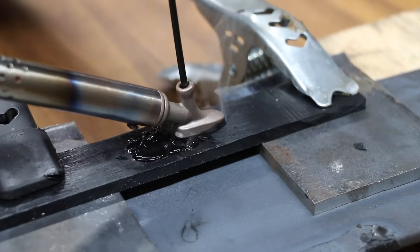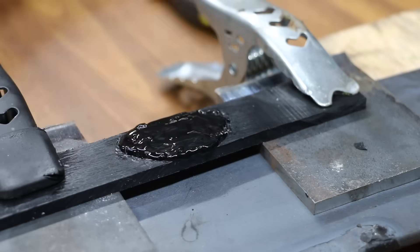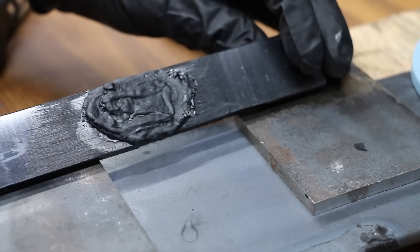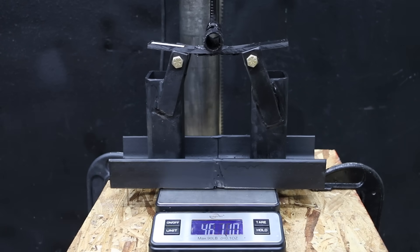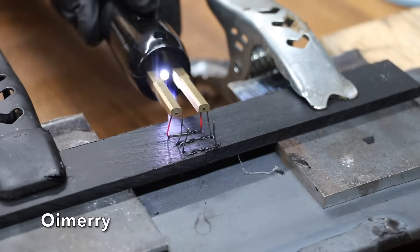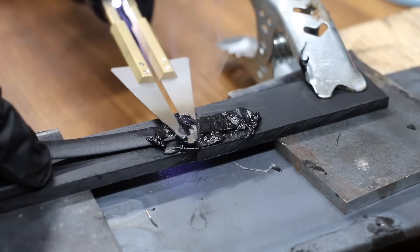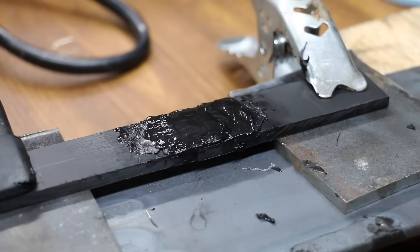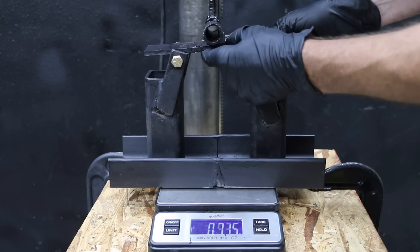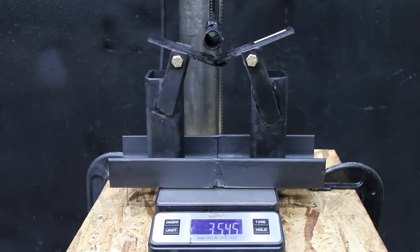Making a second June Jip repair with wire mesh, the June Jip seems far more efficient at melting the plastic welding rods and keeping the repair area adequately hot. It seems to have pretty good penetration. Unfortunately, adding the wire mesh didn't help the June Jip — 48.36 pounds is still pretty good. The O'Mary makes very quick work of heating up the staples. The first test piece without wire mesh held up really well at 53.3 pounds, moving into second place behind the June Jip. Testing the opposite side of the repair offered decent strength at just over 22 pounds.